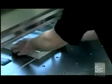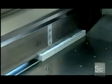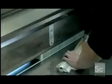After stacking the perforated sheets, workers trim them down to the finished size, usually sheets of 10 called panes. The trimming machine is appropriately called the guillotine, but unlike the head chopping version, this one slices with a sideways shearing action. That puts less wear on the blade.